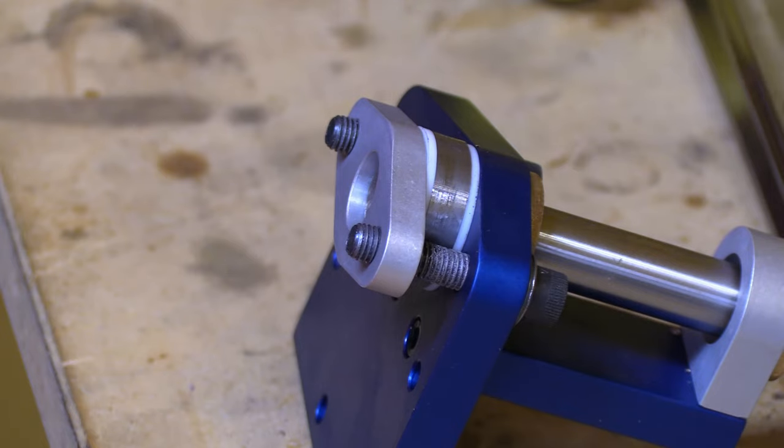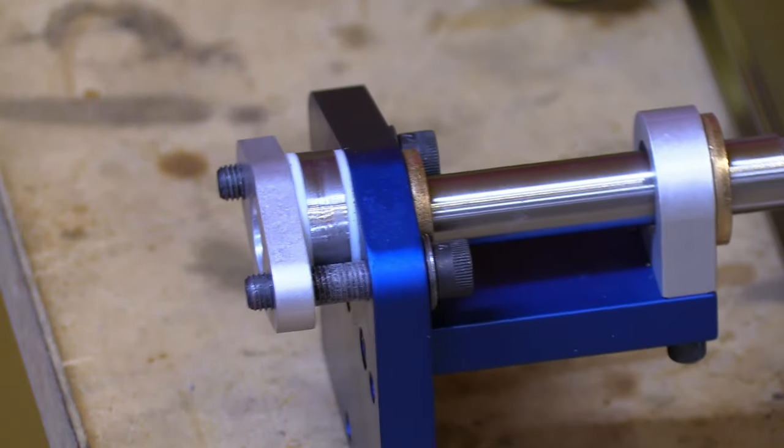Now it's time to talk about the friction elements. The Torch Armadillo has friction elements on all of its moving axes. The idea is that they should be adjusted as loose as possible — so it feels nearly effortless when you move — but strong enough that it holds position when you let go and doesn't drift. I include a nice ball driver with every Torch Armadillo to make the adjustment easier.